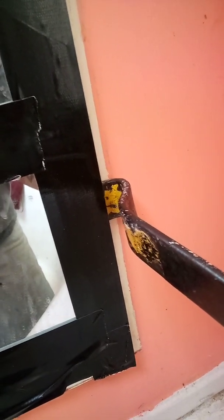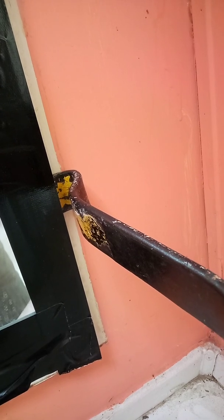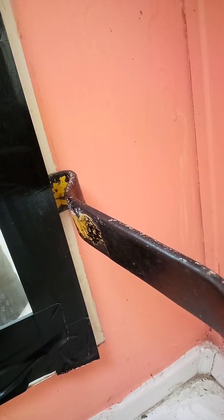If you listen closely, you can hear that paper pulling away from the drywall ever so subtly. And that's all you want. If you're using wooden shims, you're going to drive them in carefully and uniformly and keep doing this. And it's going to protect that mirror from having a pressure point put on the back of it like I'm doing right now. And if I'm in your house and you're paying me $150, $200 to remove your bathroom mirrors, there will be shims.